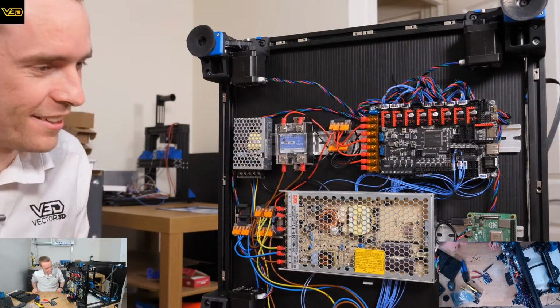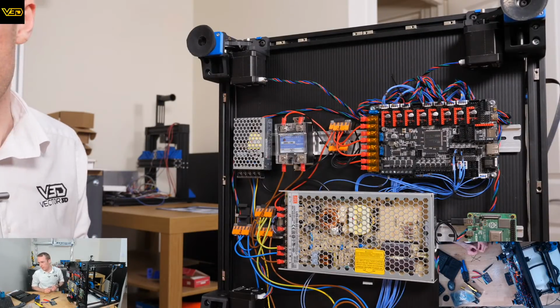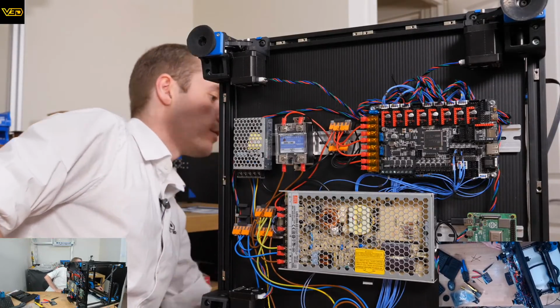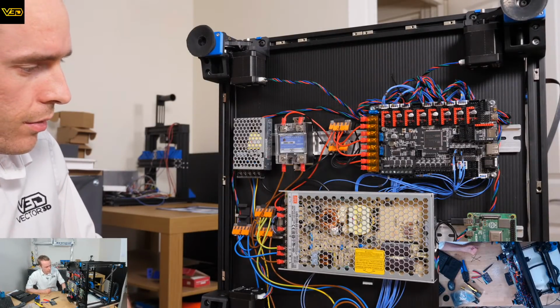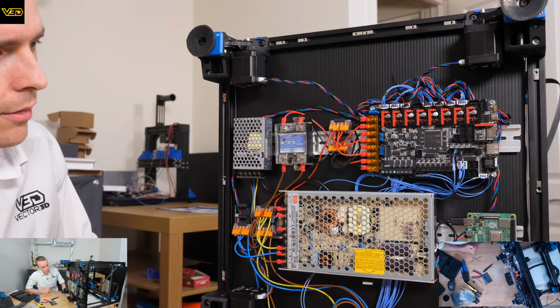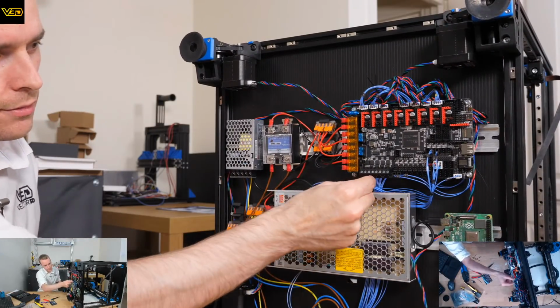Hopefully. It's just a suspicion over whether USB-C cables that can take higher currents are thicker conductors, or if the 500 milliamp limit on USB 2 style things is going to be a factor. That was generally what the discussion was. Hopefully it's going to be fine. I'm going to try it and we'll find out if it gets a bit hot.